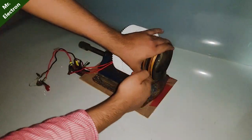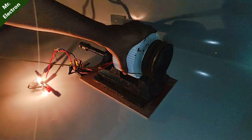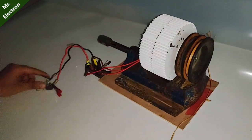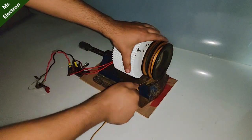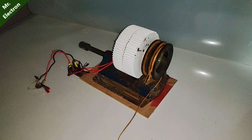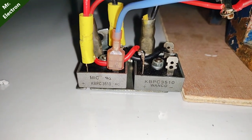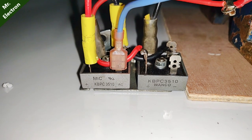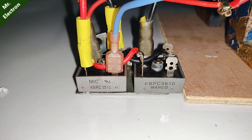Let's turn off the lights and do it once again — now only the camera lights are on. It's working and was really bright this time. Our rectifier is working great. It can handle huge currents — continuous 35 amperes and up to 400 amperes surge. You can also use 50-ampere diodes, which are just slightly bigger but otherwise identical. Thanks for watching, hit like and subscribe, and see you in the next one!